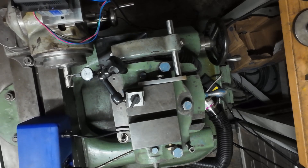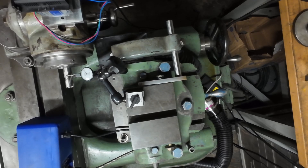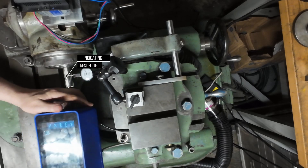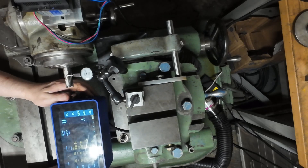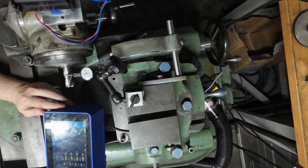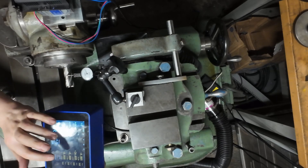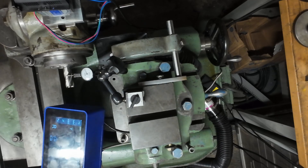I'm gonna travel now to the next flute and find the peak. This end mill is probably already ground — you can see it's a little bigger in diameter compared to the front. I would say this is our maximum. Now this gives us a number: twenty-six point one zero five millimeters. What this tells us is that the end mill flutes perform 90 degrees of rotation in 26.1 millimeters of travel.